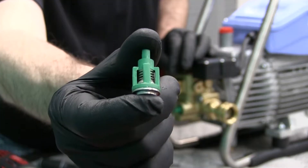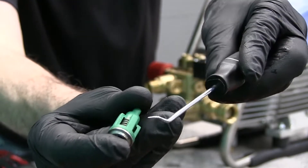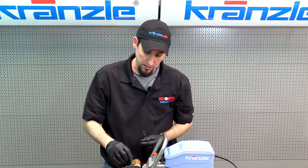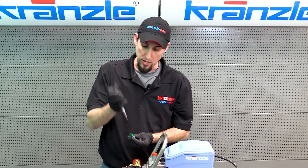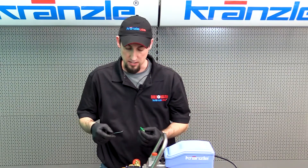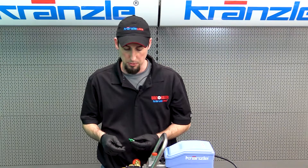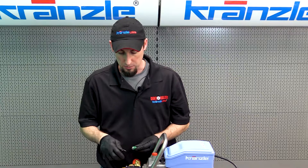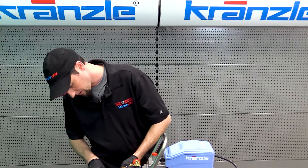Be cautious that the plastic cage can become separated from the seat. The valve cage has a metal seat on the bottom and it clips together. If there's been a lot of cavitation, the check valve might be stuck inside the housing — you may have to break the cage off and then use a pick to dig out the seat. It takes some finesse. Oxidation or calcification can build up and make these difficult to remove in some cases.